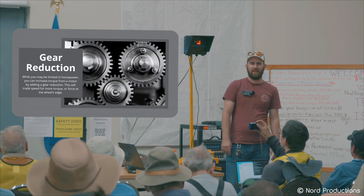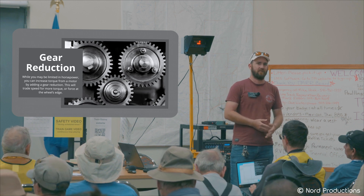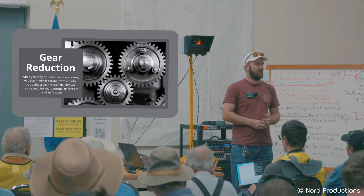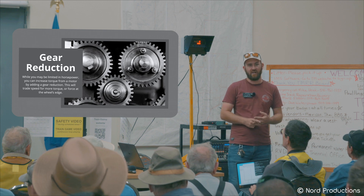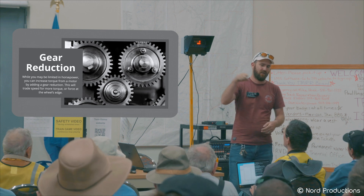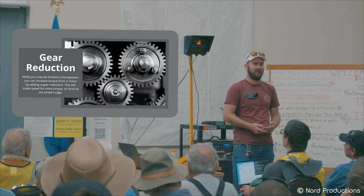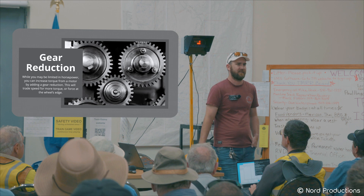Getting a little more technical: talking about continuous Tractive Effort, we really focus on torque because you're limited by your horsepower. Gear reductions — especially in electric locomotives — are probably the number one place I see gear reductions applied, and they change your torque value. Like on your bicycle, you've got gears where two turns of one wheel turns another gear one turn for every two, giving you a half ratio — you're doubling your torque and splitting your speed in half. Electric locomotives are kind of one of my special focus areas.